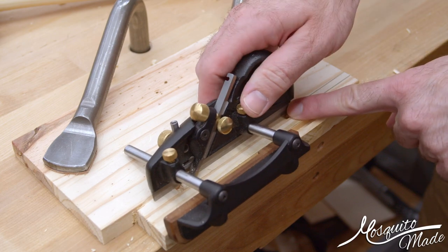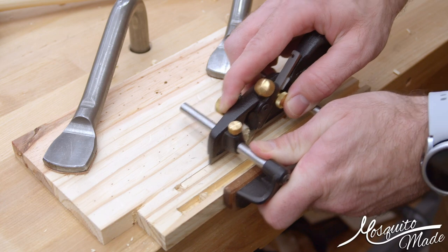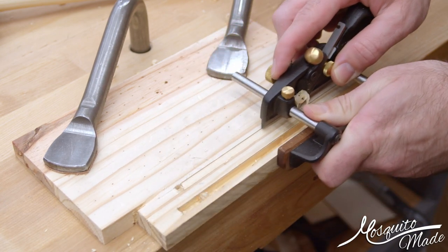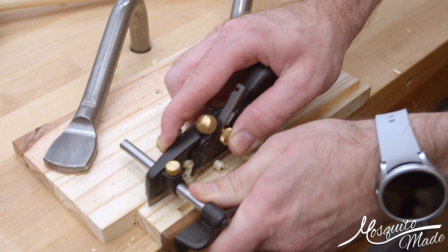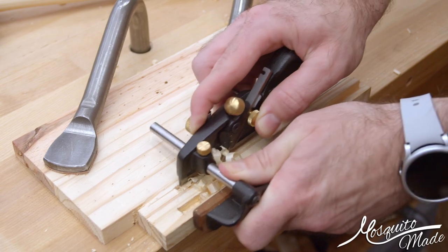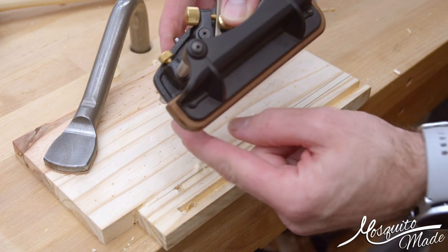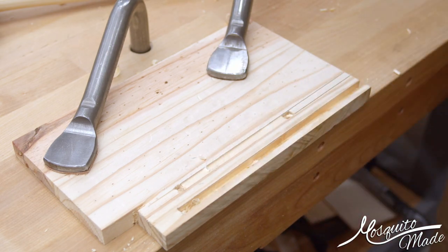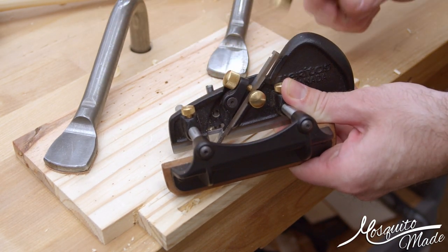With the plane iron, I've got the beginning and the end marked, and you can't do a whole lot with the plow plane. You get that first couple of shavings, but you have to be careful because you don't want to go too far and overshoot your line and ruin the whole thing. You can get a couple of passes, but here you can see I'm starting to hit that end after only two shavings — the front's plowing into that. So obviously we're not going to be able to do it just with that approach.